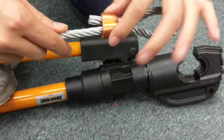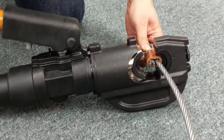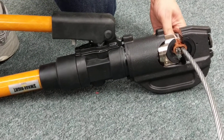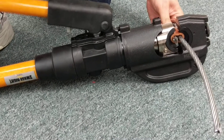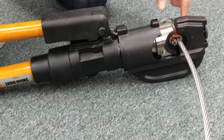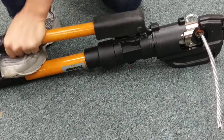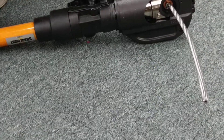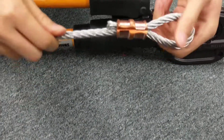So we're going to finish the last crimp right here. I'm going to take it from the back side so you can review it. Again, we're going to make sure it's lined up properly. Close the distance, and right when it's about to make contact, make sure that it's held straight and true. Then pump slowly and gently, building up pressure with small short strokes. Now that it's firm and we know it's straight and true, we can use long, heavy strokes. And that's the second crimp right here.